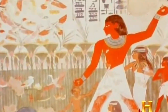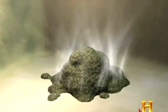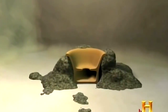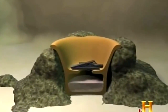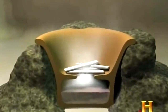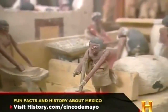The Egyptians also devised an ingenious method to make white and red pigments from lead. In mounds of fermenting animal dung, dual-compartment clay pots were filled with lead strips and vinegar. The vinegar fumes and animal dung combined to turn the lead into lead carbonate, thus making the metal white. The lead white was then ground into a powder and suspended in a binder of animal glue or egg white.